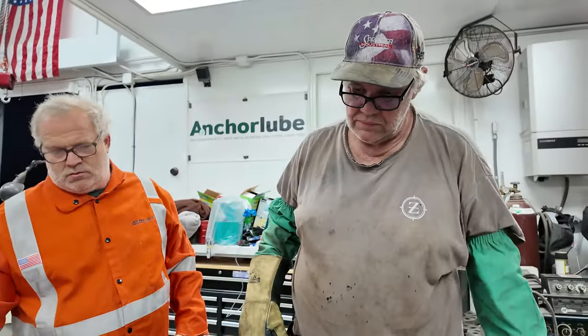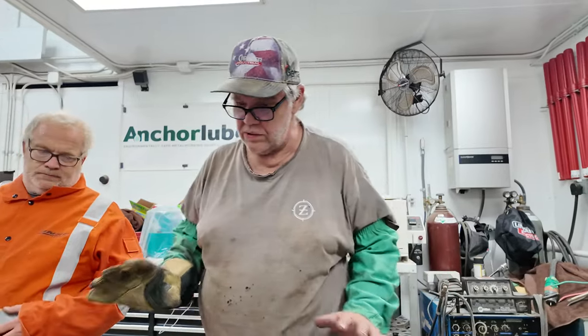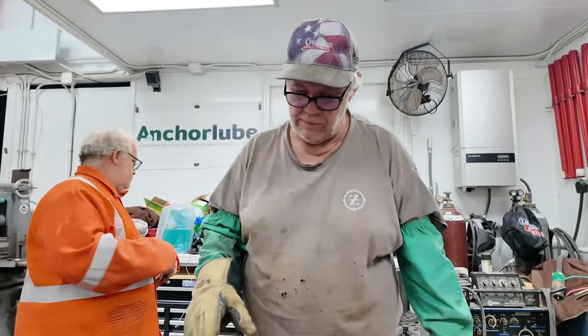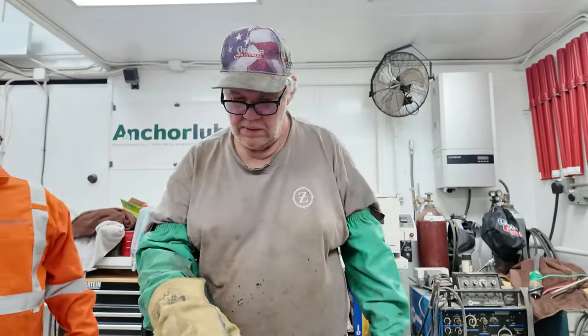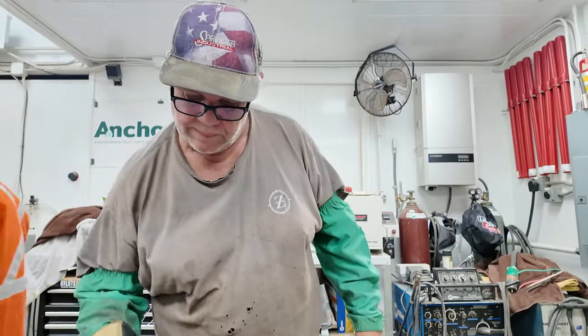And so how much did this have to cool before you put it back in and temper it? I need to get it down to about 125. Just let it sit. That gives me time to get the oven cooled down and prepped. Then we'll temper it at 500 for 2.5 hours. I'm going to look it up to see where I'm going to end up.